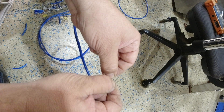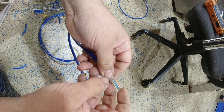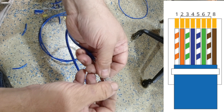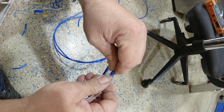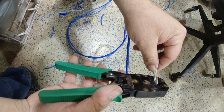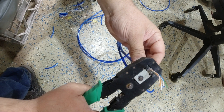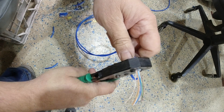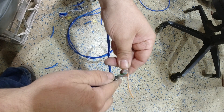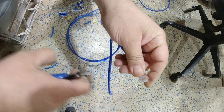They're separating — not going to get it first time. Click down. I've just pushed them all in in a line. Now I'm going to double-check my pattern: orange, yes, yes, yes, green and white, blue, blue and white, solid green, brown and white, brown. Now I'm pulling this all the way through. I need to actually crimp it — pushing it through, shielding pushed into the RJ45, and now going for the squeeze. Now I can trim off all these bits using little nibblers. If it's too long you're not going to get that click when you go to plug it in to test it. That part of it's done.